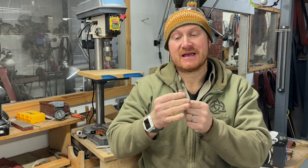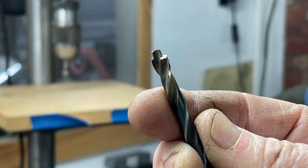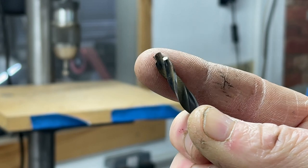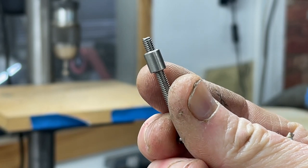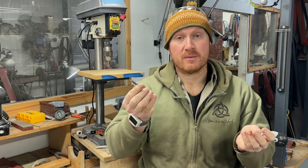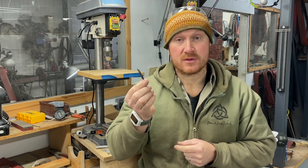A step drill can be purchased but they don't tend to work particularly well and they're very difficult to sharpen. So I produce my own counter bore drill bit by using a normal twist bit, making it so that it's got a pilot and then a proper size to accommodate the loveless bolt. You can make these to fit loveless bolts or Corby bolts, and it means you're self-sufficient — you can make every size you need and sharpen them really easily as well.